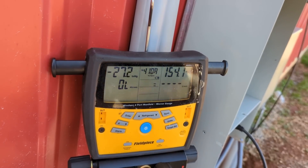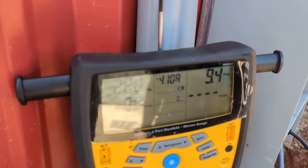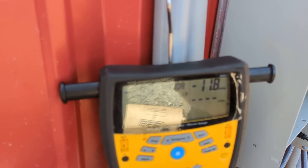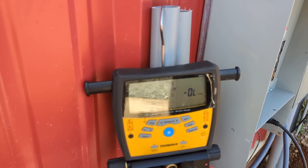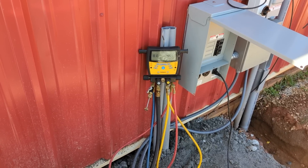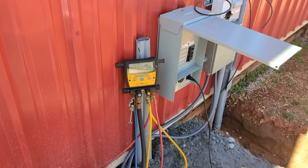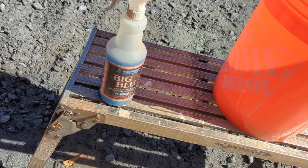We pull it down to 500 microns. You start off measuring in inches of mercury vacuum — it'll go down to about 30 or so — and then it changes over to microns. Right now we're not in microns yet, but in just a minute, if there's no leak, it should pull below 500. Once we get down to 500 microns, we hold it and see that it'll hold. You hear all kinds of things — 30 minutes and such — but pretty much if you turn the vacuum pump off and it holds for five or ten minutes, it's good. If we have leaks and it doesn't hold, we check for leaks. You can't check for leaks under vacuum — you have to check under pressure, so you put nitrogen in there and pump it up, then do bubble soaking.